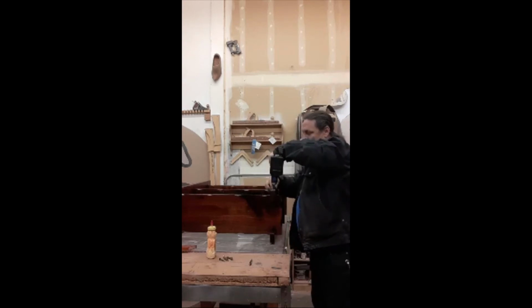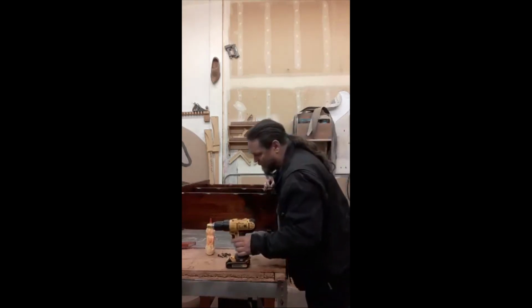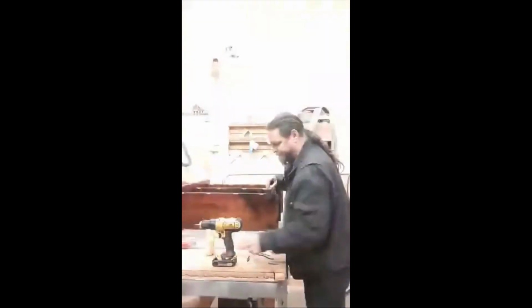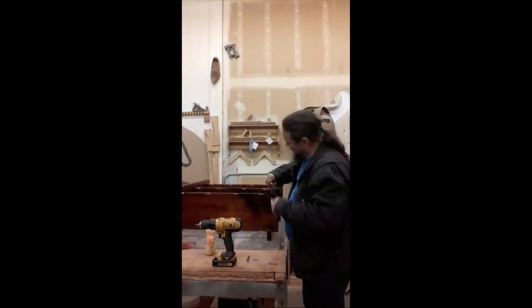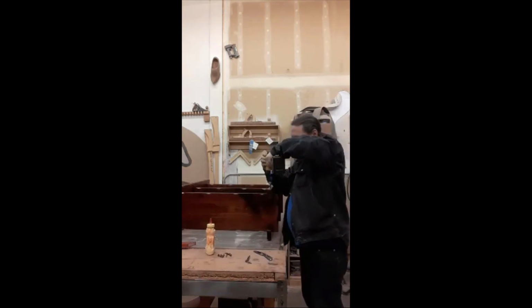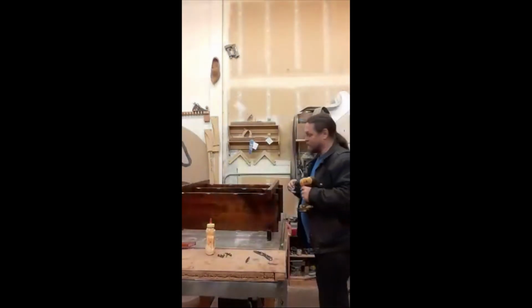Okay, I'm recognizing this particular screw. This is important. I got to get that screw back out of here. One of these screws ain't like the others. Basically, somewhere in the ancient past, this screw went missing. And so it had to be replaced with another one. And that made a different size hole in here after we fixed the hole, because it's a different size screw altogether. See? So the rest of these screws will go here and be fine.